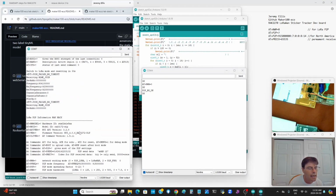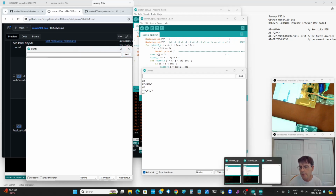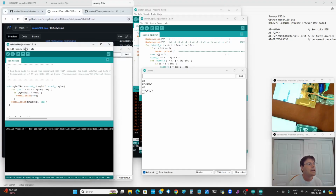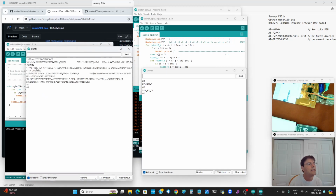But on this one, I feel like this one's frozen on me. Let's just do an AT. Yeah, that's a pain. I don't think I moved the table or anything. Let's go into that code. Maybe we should just do the same thing we did before. Load up that again. Oh, okay. So we're back on. Yay. That looks like it's in LoRaWAN mode. We can AT+NWM equals question mark just to see. Yeah, we're in LoRaWAN.